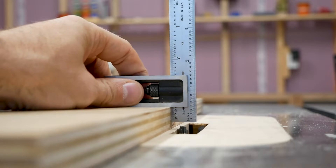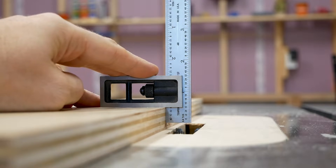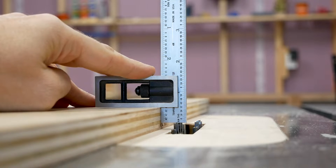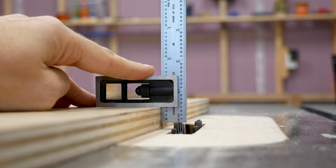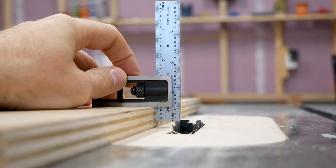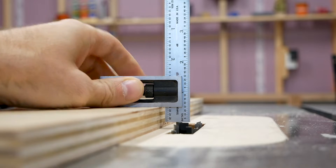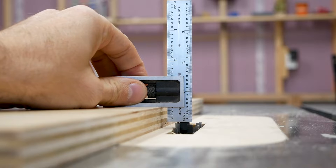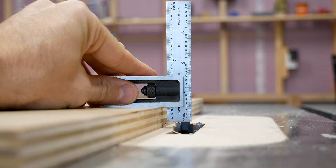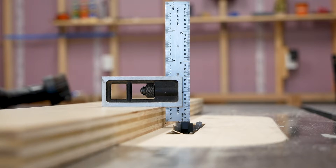As you can see here, we've got the plywood with the half inch depth, and then I can just move that dado stack up until it just barely touches the top of that outside tooth. And I can even check that — it's a little high there — bring it down a bit, right there. So that's that perfect one half inch depth, and just about a quarter inch for the dado.